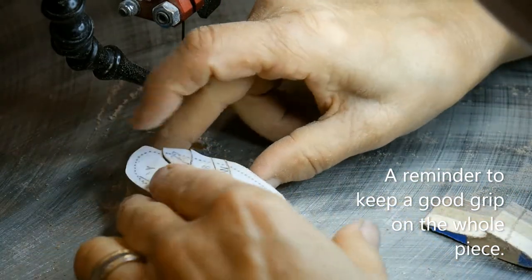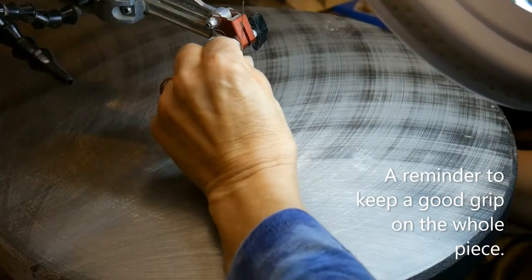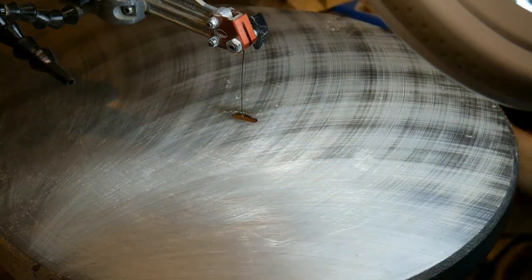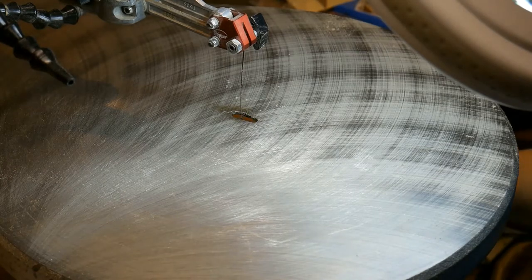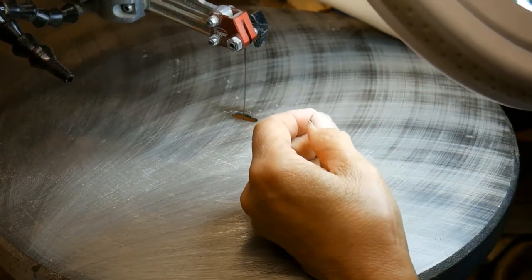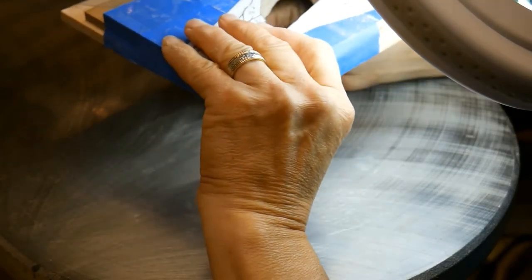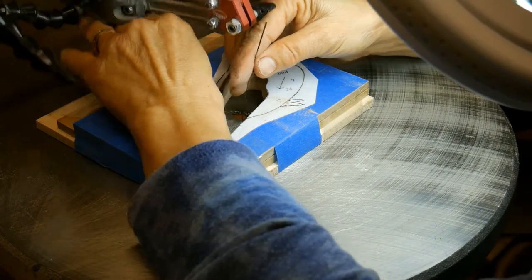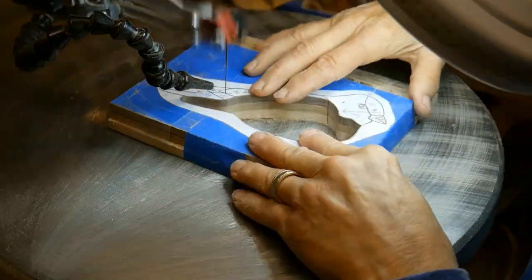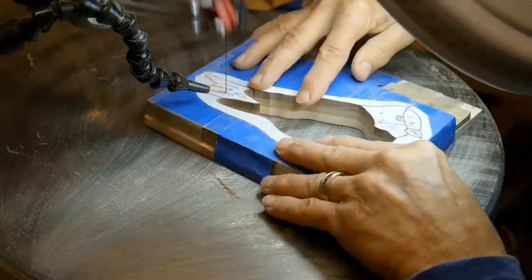After cutting the main wing piece, I'm showing how it all fits together, then I'm changing blades. You'll have to do this often because the wood is about three-quarters inch thick, so you'll probably go through a couple of blades. I'm checking for that ping on my blade, making sure it's adjusted and tightened properly. As you can see, it is much easier to cut the other parts of the bird when you're holding on to the whole unit and cutting each piece separately.